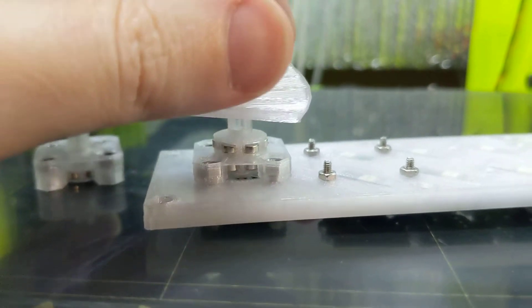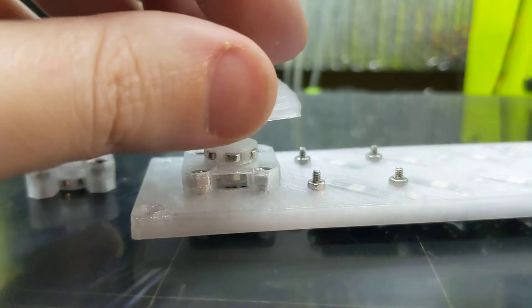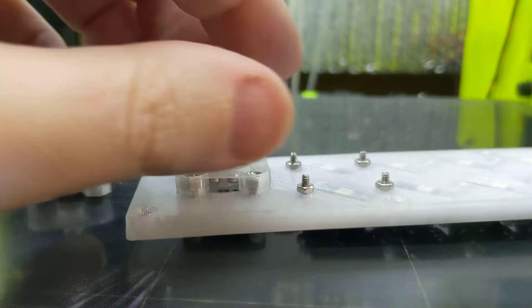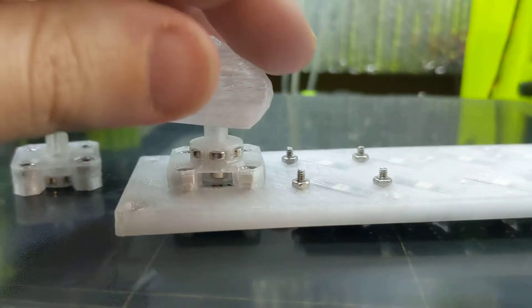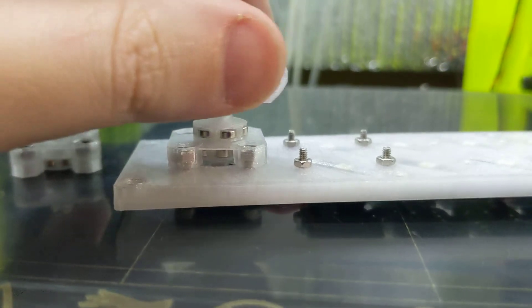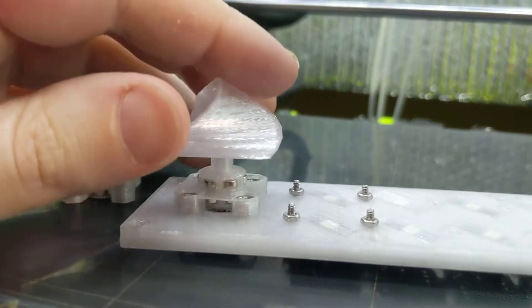You can actually feel the little bumps. I counted and it's somewhere around 26 little tactile bumps per turn, which is just like a normal rotary encoder. They're not quite as strong as a normal rotary encoder, but it's got those little tactile clicks. I could actually configure this so that every little tactile bump matches with a turn motion — an actuation in the analog rotary encoder software.